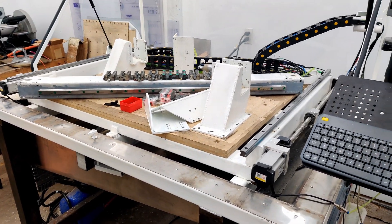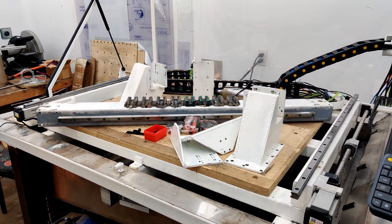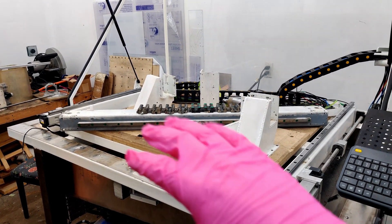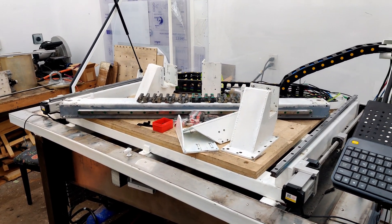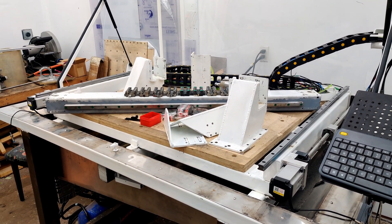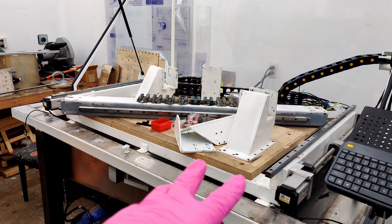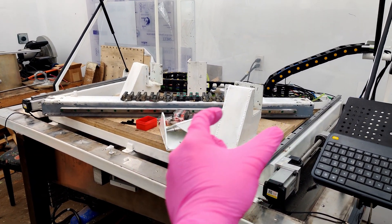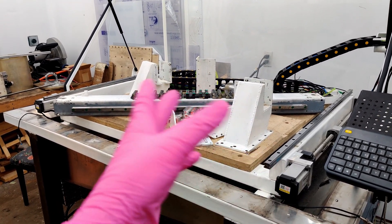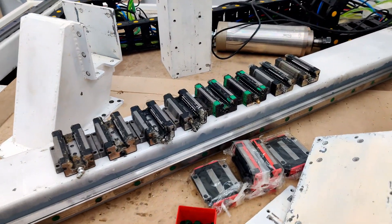The longer rails are needed because I intend to replace what's here with an MDF spoil board - that'll be a half-inch piece of steel and then probably a one-inch aluminum plate on top as a fixture plate. One inch is enough that I can skim it down over time when necessary to machine it flat again. The half-inch steel plate underneath will be good for mounting the vise - I have a six-inch vise - and I can still remove the fixture plate and mount the vise directly if needed.